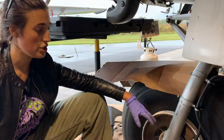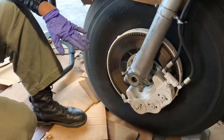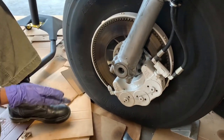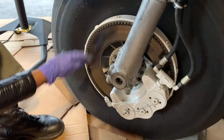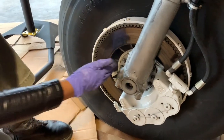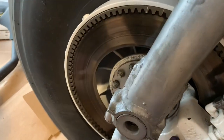This is a Goodyear brake which has a fixed caliper but a floating rotor — this is on a Beech 18. One consideration before showing this is that I didn't want to take off my gloves, so although this is going to get oily I'm going to clean it later. You'll notice that the rotor floats and moves whereas the caliper is fixed.